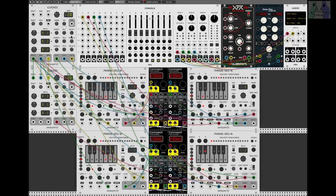And what you can do with this is then use these controls to delay clocks relative to the master clock here and produce all sorts of interesting effects. Things like strums, where each note being output from each clock is slightly delayed. So it sounds like you're strumming a guitar, playing the first string on the beat, and then each string afterwards is slightly delayed, giving that strum effect. Or you could use it for arpeggios, for example, having different clock delays, so you get these rhythmic clockings coming through to each of your sequences.